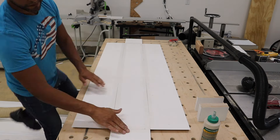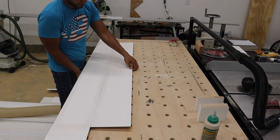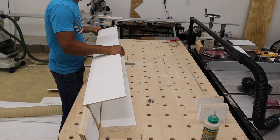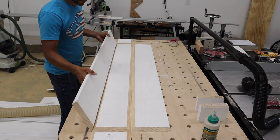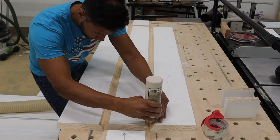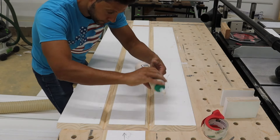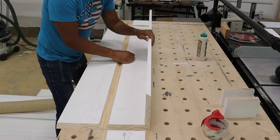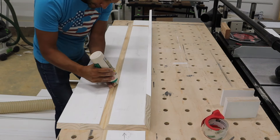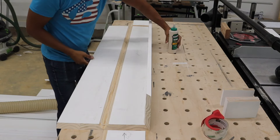Once all the tape is in place on the seams, fold it down the bench towards you so everything falls together in the box shape, then flip it over to expose the seams where you need to glue the bevel joints together. I like to use Titebond III for these glue-ups because it has a longer open time and is water-resistant. When you're doing something like this, you don't want a glue that sets too fast. Once you glue it together and flip it over, I'm going to show you a technique where I burnish the miters and make everything come together perfectly — you need a longer open time for that.